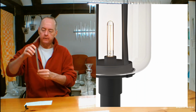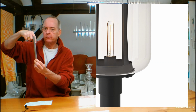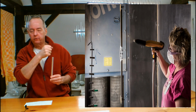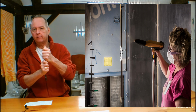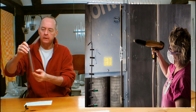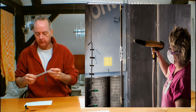So how Hubbardton does it is they take the fixture itself, wire it up at the top, put a wire at the bottom, and send a current of electricity through the fixture, making it positive. They put it into a spray booth, with a picture of the woman next to me. You can see she's spraying finish around it, and because it's positive, it's going to adhere to every nook, every cranny, the top, the bottom, the whole thing. After that, they move it into an oven. That oven melts all of that down and creates a very hard shell. So it makes it, again, virtually indestructible.